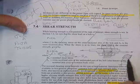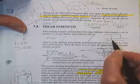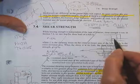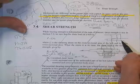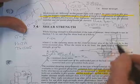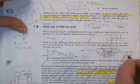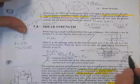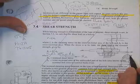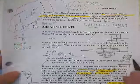I don't see one where this happened, but basically it was threaded to the head. And therefore, this one was sheared through the root area, or if you think you deserve it, the root area plus one thread. It's what they call a tensile stress area. That is, incidentally, the same stress area if you pull the bolt in tension, because you have to break it around the root, but then when it gets around to the bottom of that, it has to kick up back to the top of the bolt, and you do get a little more area inside of the thread itself.